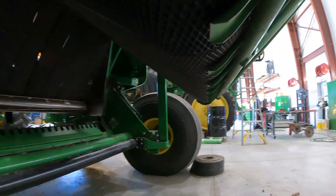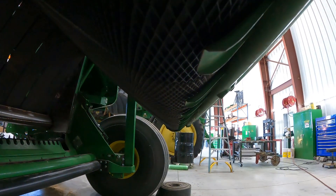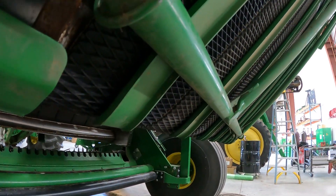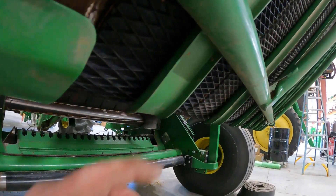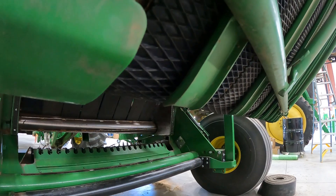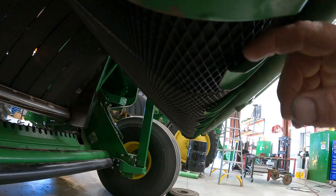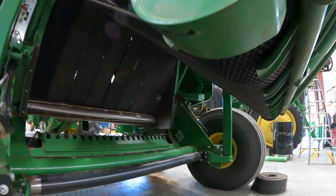When the net goes down the pan, take a look at these slats on the bottom — they have a little curvature to them. If you're baling in wet conditions and get a lot of material on the number nine front lower tailgate roll, it can bend those slats down. When it bends those down, it doesn't feed net up into the baler properly and throws the timing off, so you won't get net into the bale as fast as you'd like. All you need to do is take a hammer and tap those to get that curvature to line with the belt.